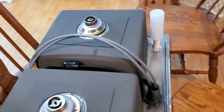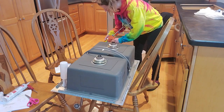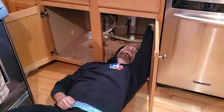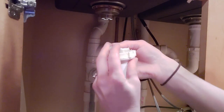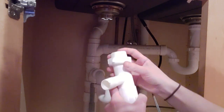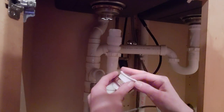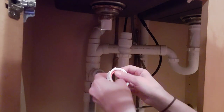This is the part where we pretended to be plumbers. I applied a strip of clear silicone to the bottom edge of the sink where it would meet the counter, and then for another team building activity, we carefully lowered the sink down into the now appropriately sized hole. Scott worked on securing the sink to the counters with the provided hardware. We are now cutting pipes and making them fit. We did have a few extra expenses for the sink and some small plumbing items, but overall we stayed under $1,000 — a massive savings from our initial $13,000 quote. We both have very little plumbing experience, so if you are unsure, I would recommend hiring someone for this part.